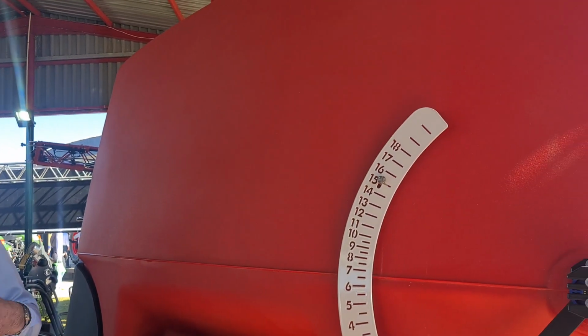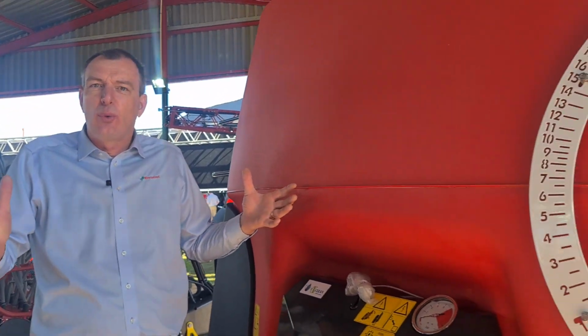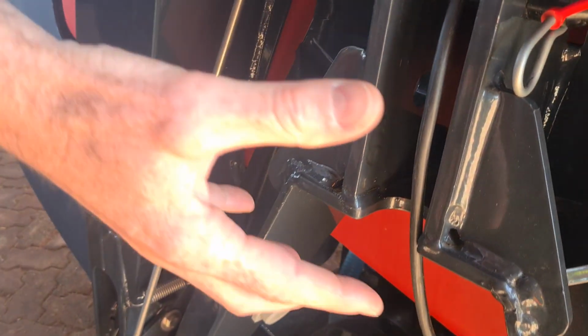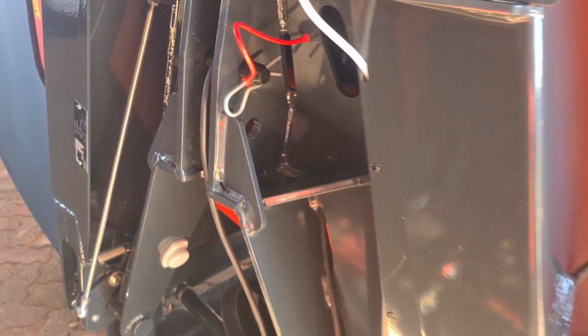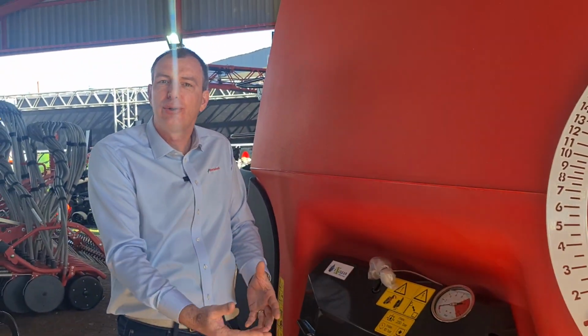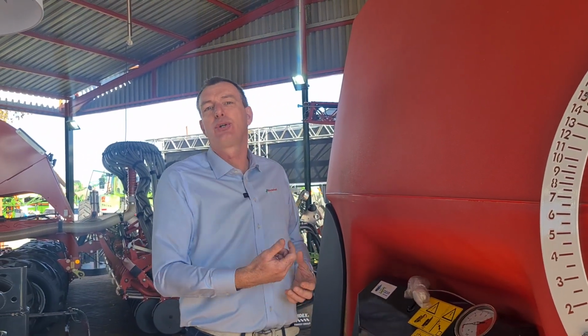Awesome. And okay, tell me a little bit more about the sprayer itself. We talk about a mounted machine, so it's not only about the weight, but also how close the weight is to the tractor. And to get the weight closest to the tractor, we work with this quick hitch triangle. On some tractors you really need it. You put in the triangle, you put the tractor half a meter in front of the machine, you hook on the PTO and the hydraulics, and then you hook on the machine.